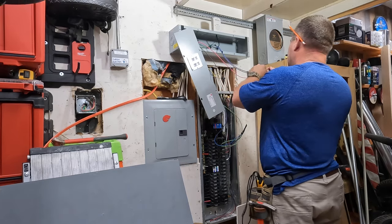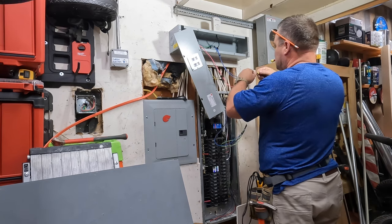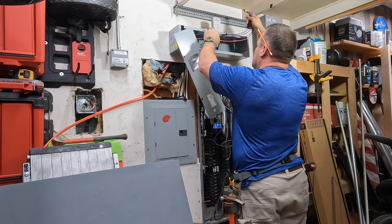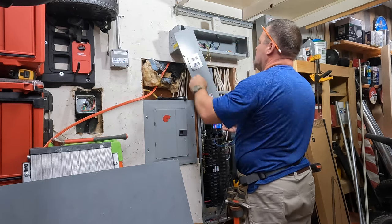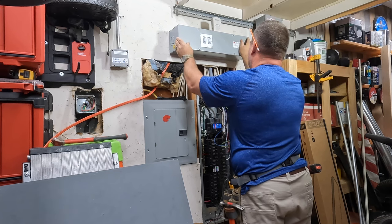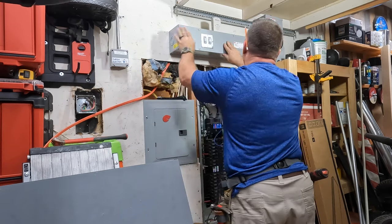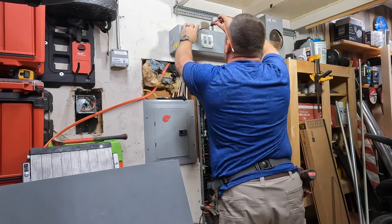I have the wiring trough with the watt meter attached to one of the holding screws on the trough. What I need to do is join my wires, but more importantly I need to get the current transformer around those conductors so they're able to measure the amount of wattage I'm using while the generator is running. It's a good place to have that watt meter right by the panel — as you turn circuits on you'll hear the generator dip and know exactly how much power you're using.